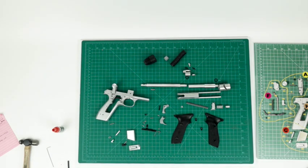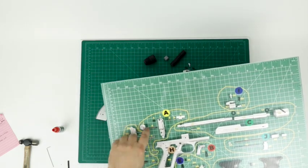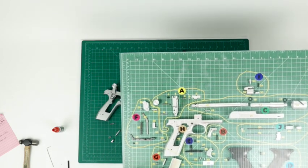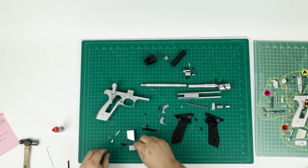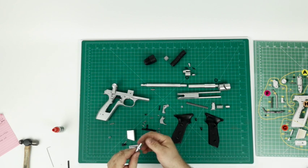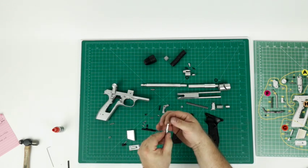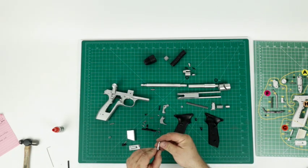All of F is done, all of A is done. I'll drop down to G because since we were working in the back strap hole, we'll go ahead and finish that up. This is the catch — it's two pieces: the rod and the actual catch part. Screw that in there. It's important to line this up and the distance is adjustable. You want the hook facing this way and the hole this way. It's not important for that to be tight — that's just for distance.